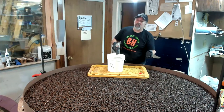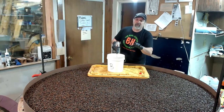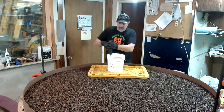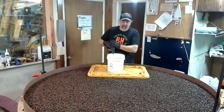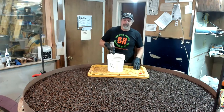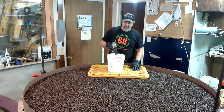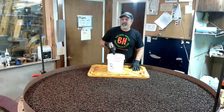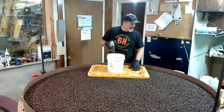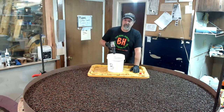Normally, you would not pour 2.5 inches of epoxy, or it'll crack. I mean, if you use Mike's Supercast, you can do that, but I'm just using regular countertop epoxy. So this isn't recommended for deep pours. However, with all of the beans in there, it's not a deep pour. It is a whole bunch of small fragments of epoxy.